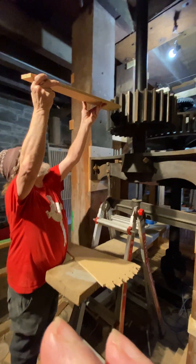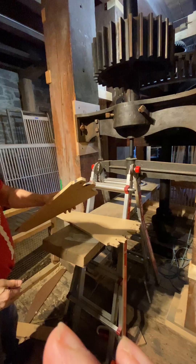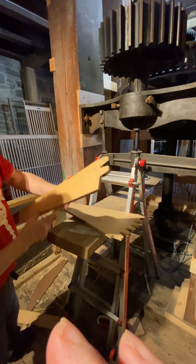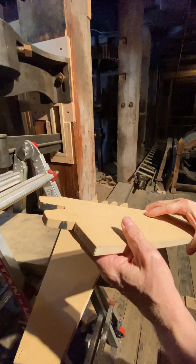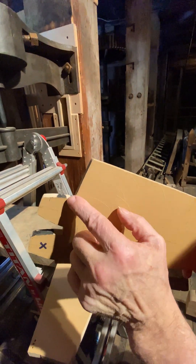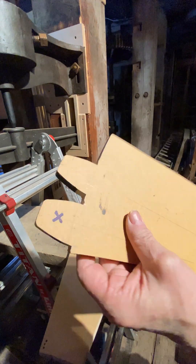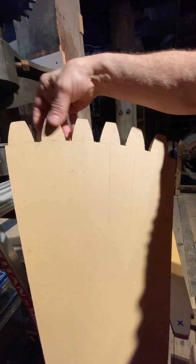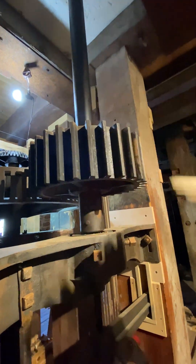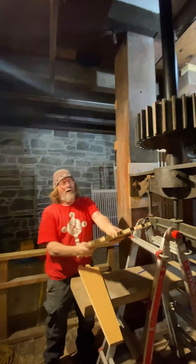What's great about the graphite lubrication that's on these gears is it allows me to roll these jigs I've made of the tooth configurations, and it leaves a little mark. The brilliant part is I've got the diametral pitch located on that — see that little mark left right there? That's exactly in line, and so that tells me that that tooth is rolling in and out of those gears in a perfect configuration.